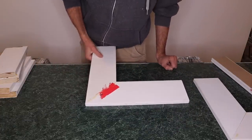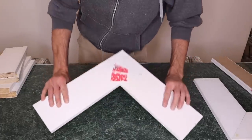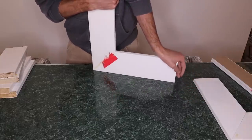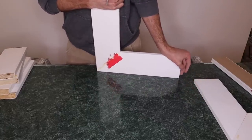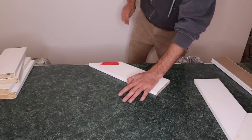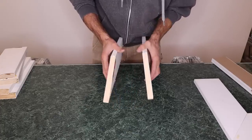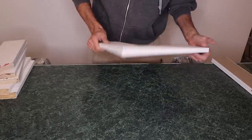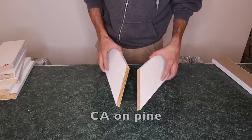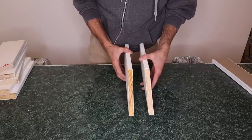Next, casing-like miters. Here's a regular wood one. There's a lot of glue in there, it's tight. That's hard — no way I can pull it apart like that. Absolutely not. Okay, that wasn't too hard, but it was definitely a well-glued joint. How about the CA glue one? Let's see how that one holds. Whoa — okay, that was really easy. That was the pine, and it came apart really easily — way easier than the regular wood glue.